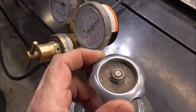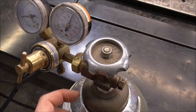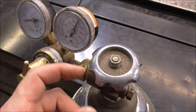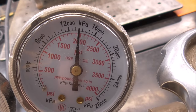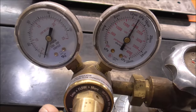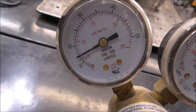We'll throw this in synergic mode. We already know the material is 10 millimeters thick, so that's what we'll set it for. When you open the gas valve, you want to go all the way open — they have what's called a back-seating valve. If you open it just a little bit like you would for an acetylene tank, it can actually leak past the packing. So make sure you open your non-flammable gases like C25 and argon all the way so the stem seals when it's open. We've got just about a full tank, right around 2,000 PSI. The flow is currently about 19, and we want to lower that to about 15.